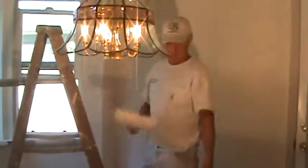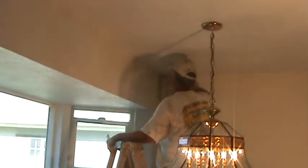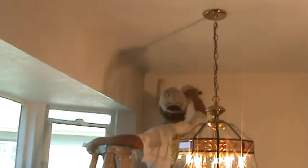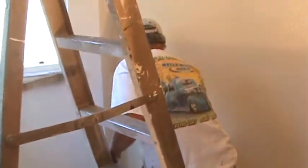That's why I like to use a little extension pole for myself, or a broom handle, whatever. And when I'm doing a different color on the ceiling, like we're having a white color, I'll turn the roller sideways like this and get as close as possible to the ceiling and then finish off cutting it in with a brush. The closer you get with the roller, you have less area you have to brush. But for a first timer, if their hand's not as steady, I don't know if they should get that close. You got to be mindful of how close you are. Usually with a nine-inch roller you have more control to get as close as possible.